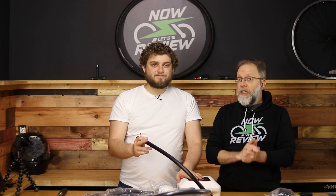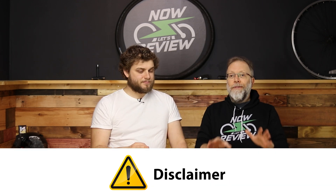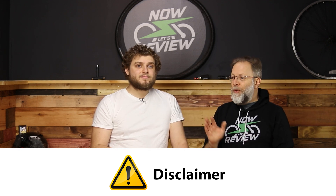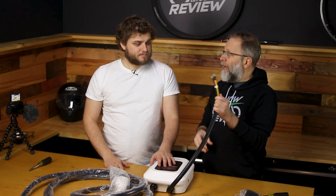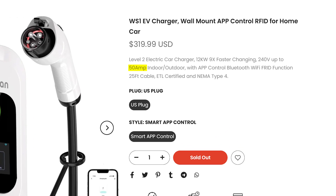We'll show you what to do, but disclaimer: every jurisdiction is different, so read the fine print — we're doing it the way it's done in our neck of the woods. There are two things you could do: you could wire it directly into an outlet or a panel, or you could do what we're gonna show you how to do right now, which is to put a plug on the end of it — a $20 solution. The first thing to do is look up the specs for your particular charger and find out how many amps it's drawing. Ours is a 50 amp EV charger.